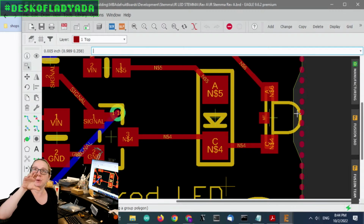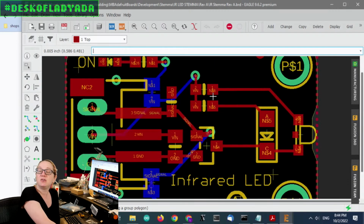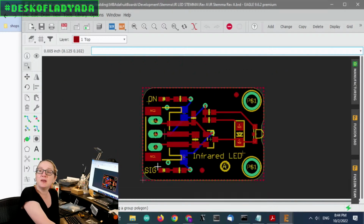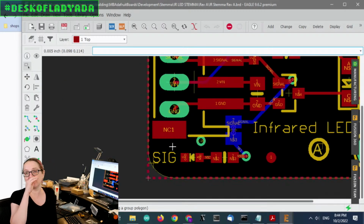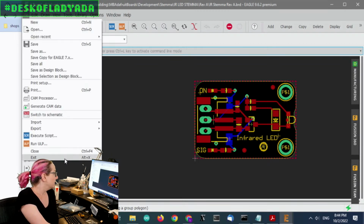So one points out, one points up, because people are going to want to have it cover an area. And it's always, do you want it pointing out or pointing up? And I was like, well, let's have one of each. Who cares? They're 10, 15 cents each. Each has its own resistor, and it's just powered by this transistor. So very simple. And because infrared is not human visible, this has a little red indicator to let you know there was signal received. So this is a simple little breakout just to solve that kind of problem, which I've seen a couple times.